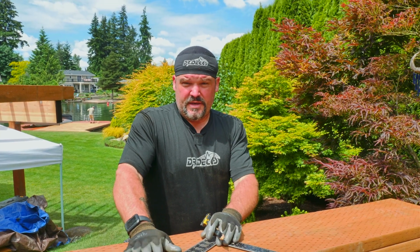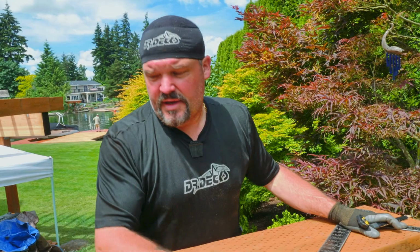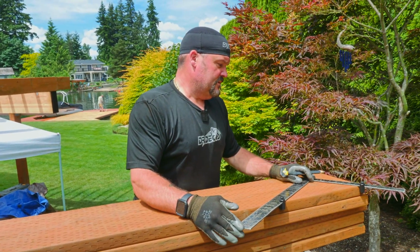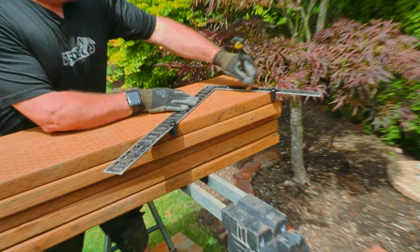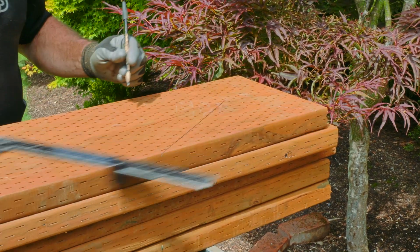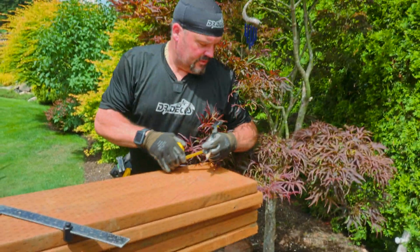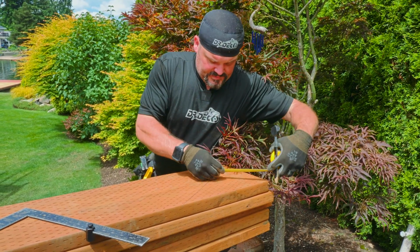All right, so now I know I need 5 rises. So I'm gonna start laying out my stairs. I'm gonna start on the high side. This will be my high side, this will be my low side, okay? So what I'm gonna do, I'm gonna trace this. I'm just gonna lay one out real quick. I'm gonna set that to the side, come back and measure it, make sure I'm happy. Hello, tree. I'm happy with my rise.